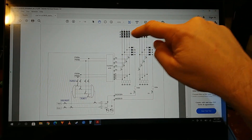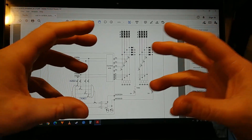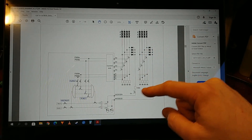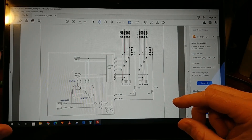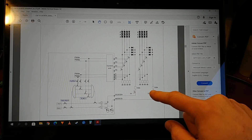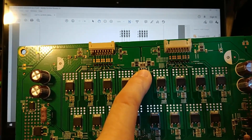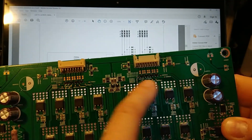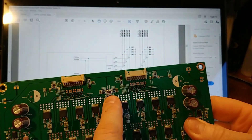This is the explanation of how the chip sees what's going on at the outputs of the LED strips. Up here we have the backlighting LEDs, and it uses a diode on each channel to group all the signals into one main signal — actually two main signals — but it's looking at all the outputs at once. It's looking for high voltage from an open LED, coming in through these lines. Here it has some 100K resistors — right here — and these three-pin components are rows of diodes grouping everything together. You can trace it: it comes in here, goes through here, and there are those 100K resistors.